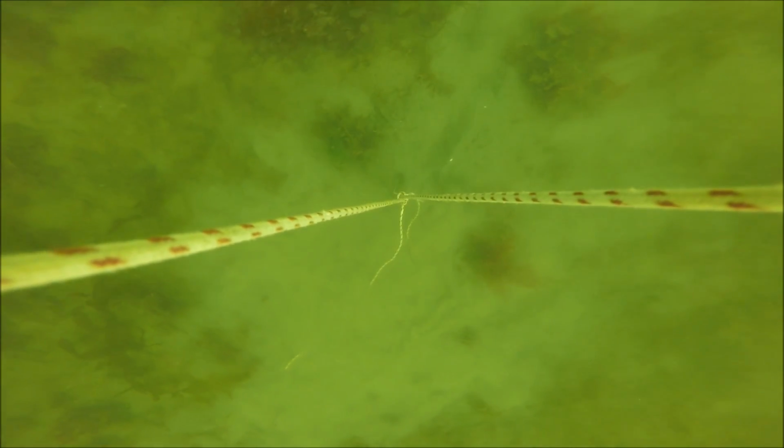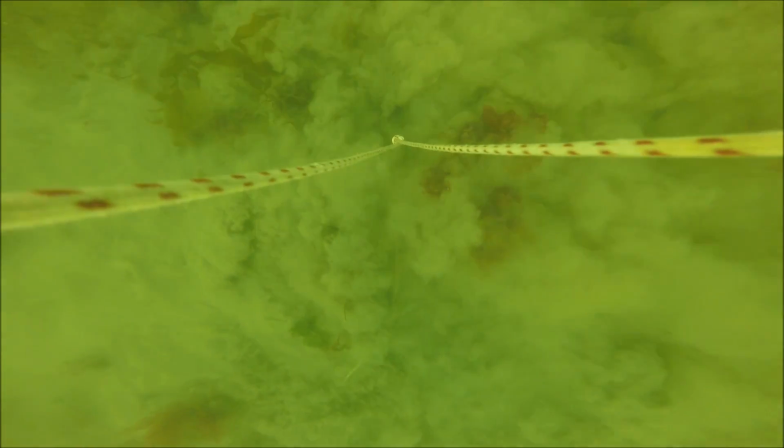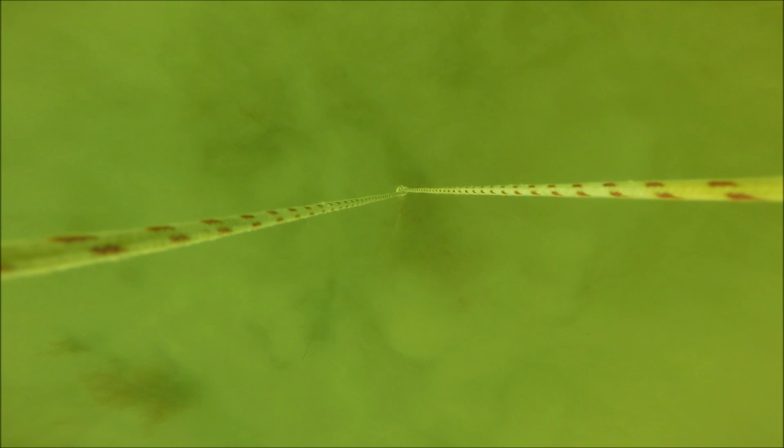Here's the first reset. That's just about textbook. The anchor does not release. It remains engaged with the seabed and just rotates and brings the boat to an abrupt halt. Here comes my second reset. Boat's going by at 3.5 knots. Now I've slowed the motion down, and I think we're seeing one of the stocks upending. So the anchor gets flipped up over on its side and releases.